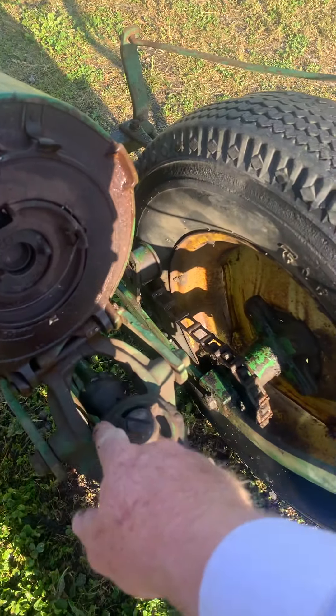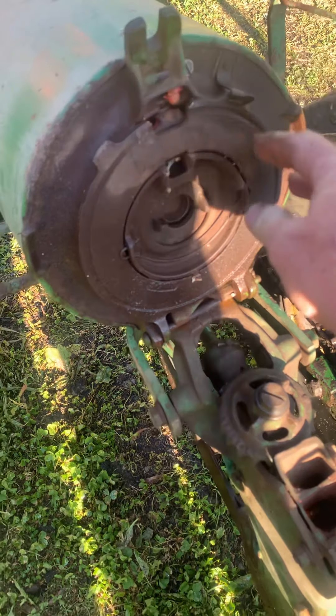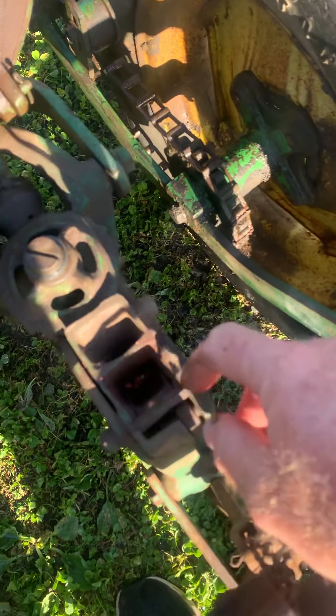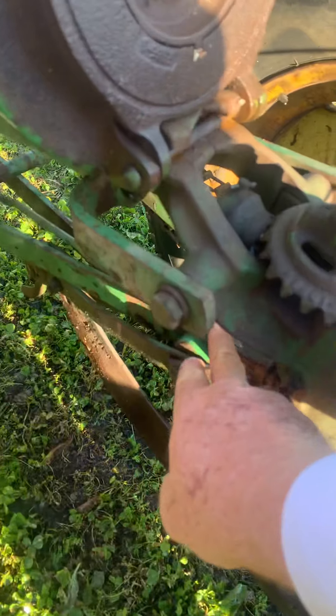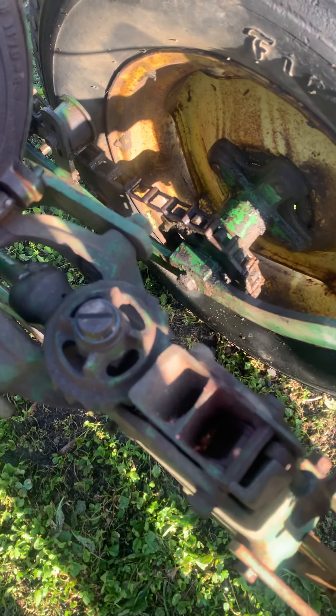This unscrews and opens up, and these will actually come out and come off. This is how you get to the planter plate. You pull that back and then that falls down — the planter plates are inside there. These spots right here are where the seed goes down to the ground. When it's in the raised position that's closed; it won't open until you let the planter down. There's a rod right here that you can adjust — there's one on each row. Make sure you get it in exactly the right position so you can tighten it back down.